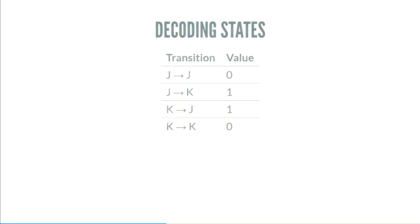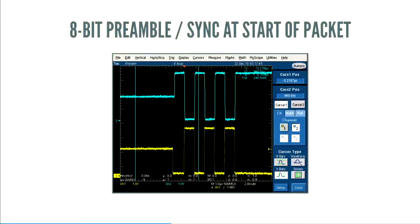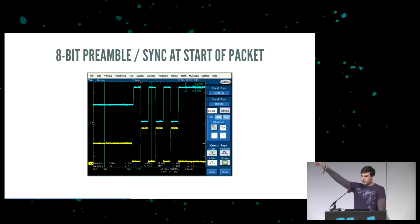So you count the cycles at the beginning of this up-down. What you do is you continuously run about a four-instruction loop, which is very similar to what it would take for full speed. You keep comparing it with itself and looking for it to change, and as soon as it changes, you know you're synced up with the beginning of the pulse. And from then on, you assume you might drift a little bit maybe, but it's only 11 bytes, and so it ends up working just fine in the end. Thanks.